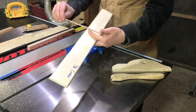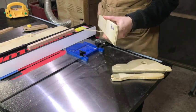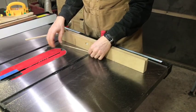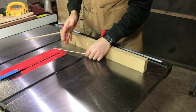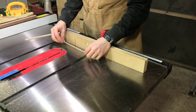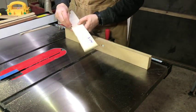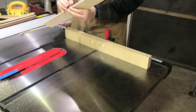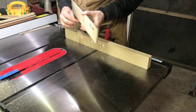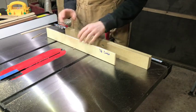I know it only needs to go back about a half inch to fit in there, so I'm going to come out about three-eighths of an inch and cut that off. If you're not comfortable cutting really small pieces on the table saw, a bandsaw or Japanese pull saw can be great here to avoid splitting or chipping. After we get it cut out, we'll test the fit again. That's perfect — about three-eighths of an inch out. That's not going to allow for any bending, and the harder the wood you use, the more stable this is going to be.